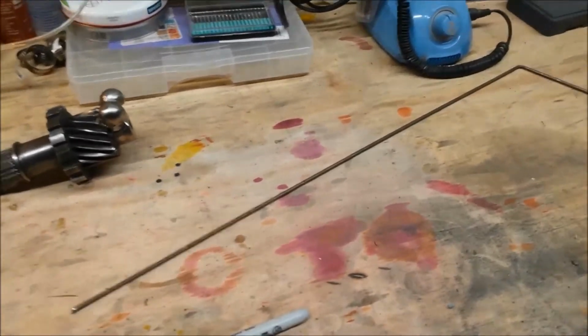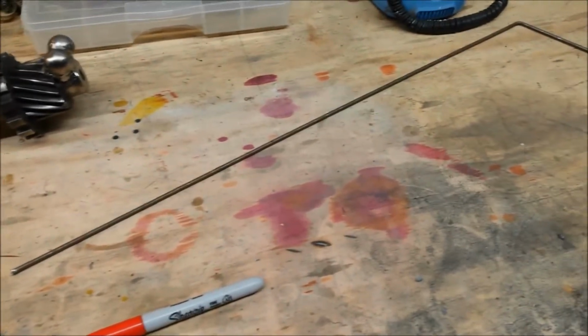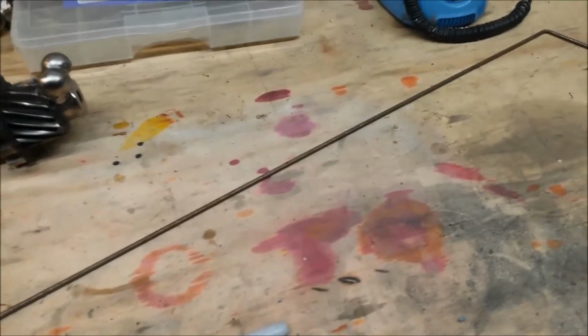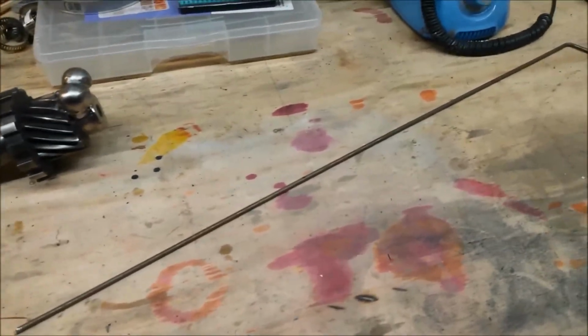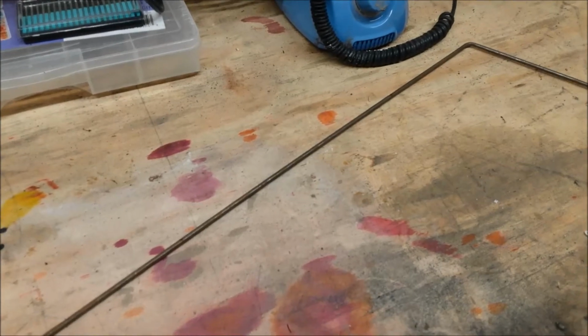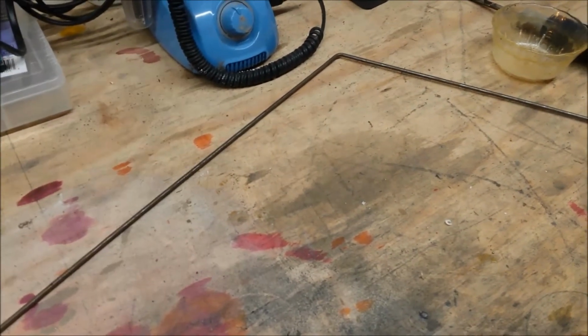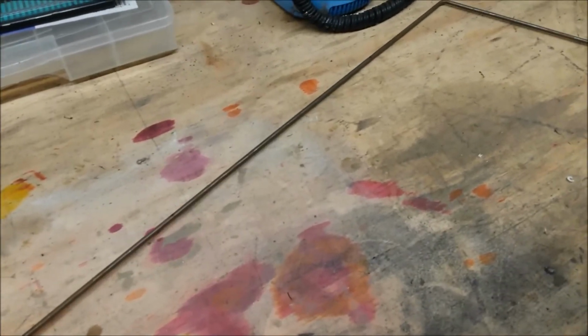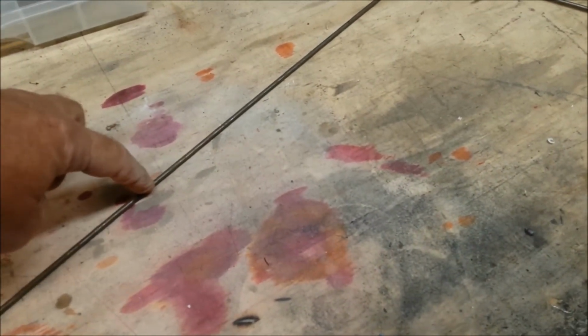I'm going to fashion some legs for this character. I think what I'm going to use is this steel. These are from like the political signs. You know, vote for somebody. You see them out this time of year anyway. I'll cut off like 9-inch sections. And what's good about this stuff is it's very strong. You have to heat it to bend it. And once you bend it, it stays put. It's about 150 thousandths in diameter. So I'll cut 3 pieces and give me 6 legs.